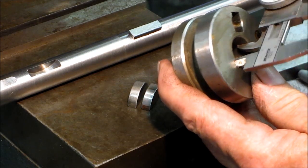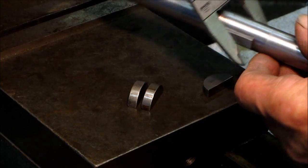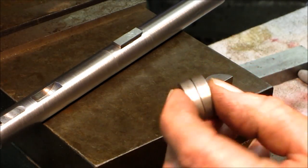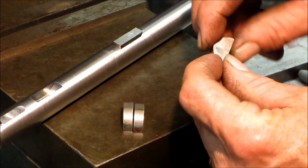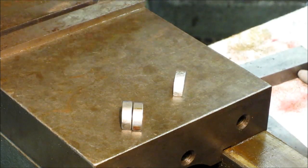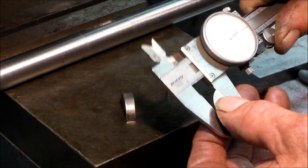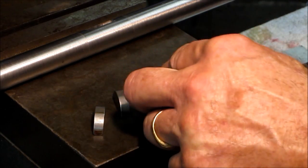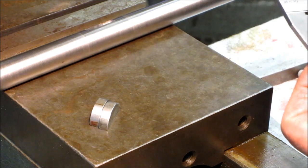We're verifying the heights. We measured our bore and got 0.865, then measured over this and got 0.884, so we're a little bit high. The reason is the two original keys have flats on the bottom where they were adjusted — these new ones are round. So we're going to kiss off about 20 thousandths off the bottom. We know we've got the right groove length because we've got excess on both sides. We pull these out and put a flat on them — one is 0.427 and the other is 0.435.